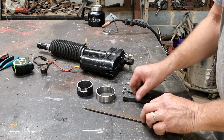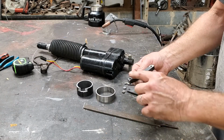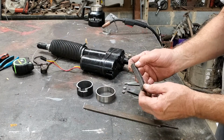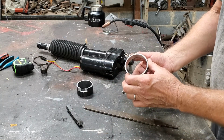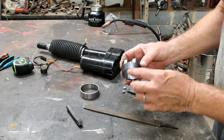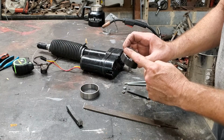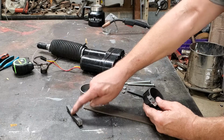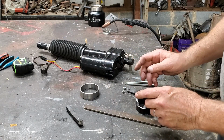So these are the pieces that I just made. This was that square bar. I drilled a 1/4 inch round hole in there and gave it a kind of a bend. Now you can see it's hammered. This is not brain surgery or rocket science. You can do this. This was the 2-inch or 2.5 inch piece. This was the 2-inch piece that I cleaned up, and I notched that with my portaband, and all I did was the thickness of the wall to slide down and make a contact with the bar stock that I'm adding on to. So I'm going to go ahead and put this together, see how it works out.